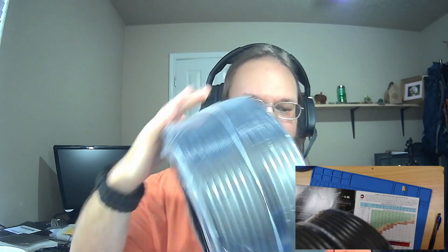For all my HF runs inside, I got this big ol' large mass of cable. The same reasons apply for choosing the 7 over the 10: losses on HF are much, much lower than UHF and VHF, so you can go with a smaller cable. That's why I got the 7. And I got a lot of it — I think this is 200 feet.